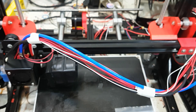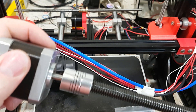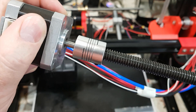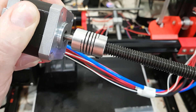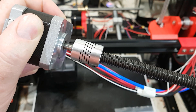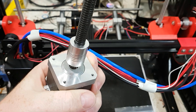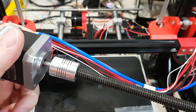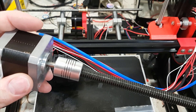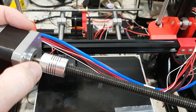Before I go, I want to talk about the spring couplers. One of the problems with spring couplers is that they're a spring — you can push it together and pull it apart. Pulling it apart is debatably not too much of an issue, but being pushed together can be a problem. I dislike anything with a spring in it, and I've realized you can actually use the spring to your advantage by stretching it to pull the two parts together instead.